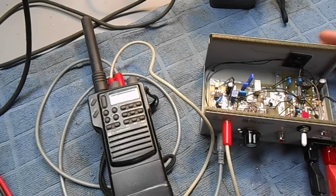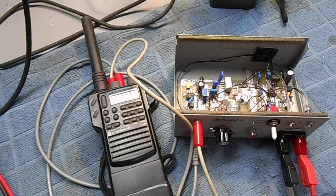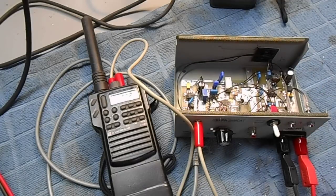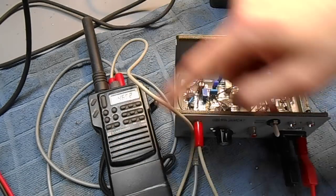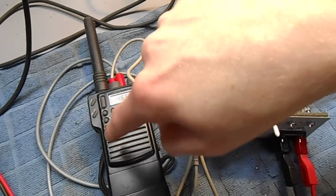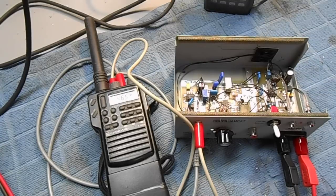Right now the internal noise generator is on and powered up. If I key an external radio, you can hear it key up — that noise you hear is the internal noise generator. There's also an external option where you can add an external noise source; without a tone generator hooked up it's just a CW carrier. I'm keying an off-camera external radio, it's being detected by this transceiver, and the audio output is keying the transmitter portion of this radio — you're hearing it on the external receiver.